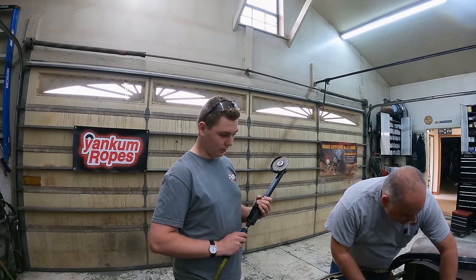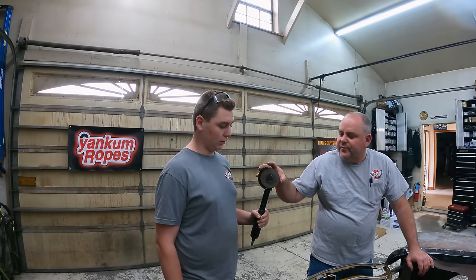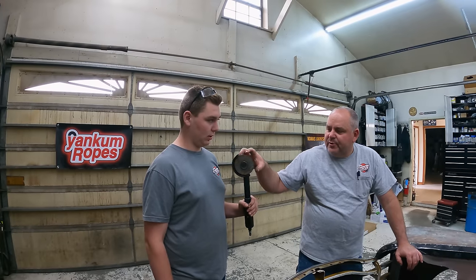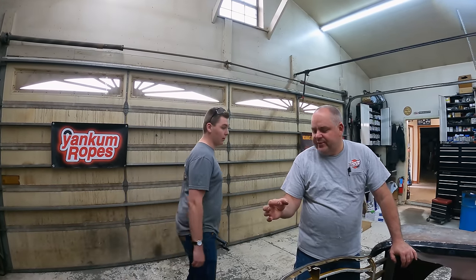You can come in like this and hold it with a smaller wheel, because you're going to want a smaller cut-off wheel than that. Do you want an eighth inch or sixteenth? Doesn't matter — I'm more worried about diameter. Get one that's probably like two to two-and-a-half inches in diameter.